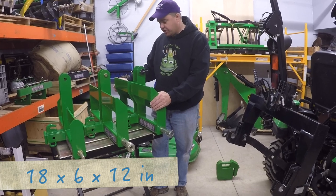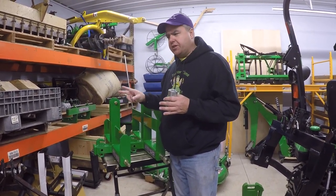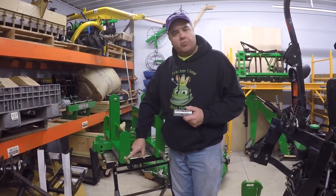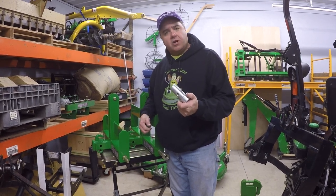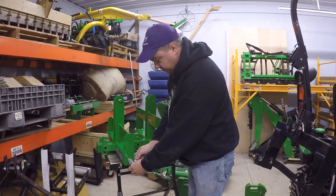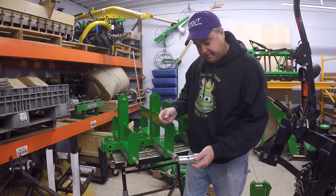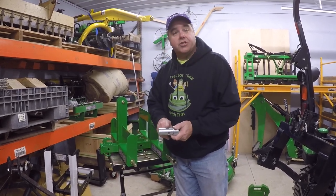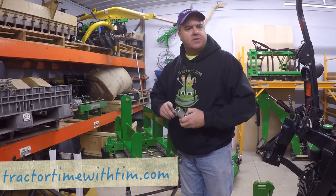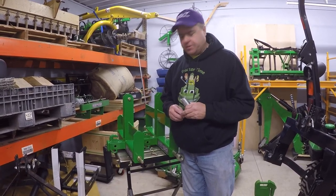I should take just a moment to talk about quick hitch compatibility, not only of the Heavy Hitch, but of most category one three-point hitch implements and most quick hitches. Usually this is a typical category one size pin on the lift arm. In order to make it work on most quick hitches, you have to have these bushings. You slide them right on there, and there's a roll pin that you insert and hammer in, and they will stay tight. Here's an example of one that's in and permanently fixed. There are a few quick hitches that don't require these bushings — the two I can think of are the Land Pride QH05 and QH10. I've got a web post about quick hitches, the various models, pluses and minuses of each one, on our website, TractorTimeWithTim.com. We'll put a link in the description.